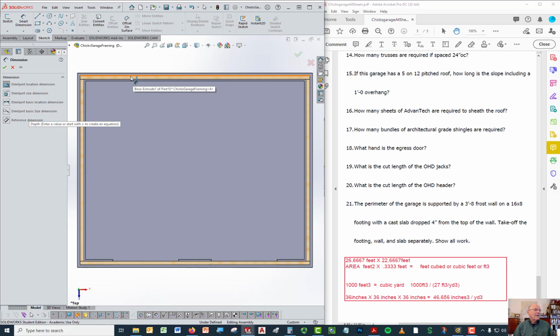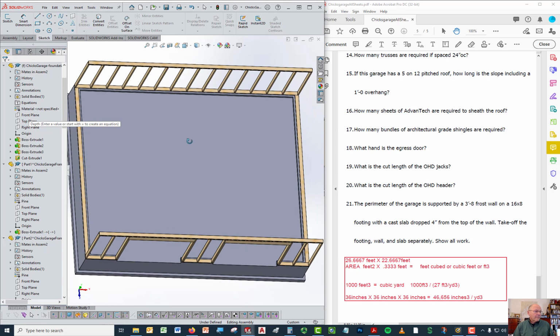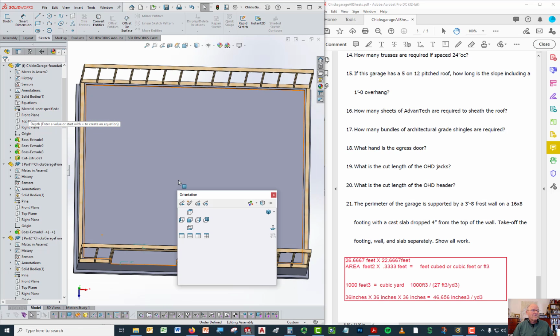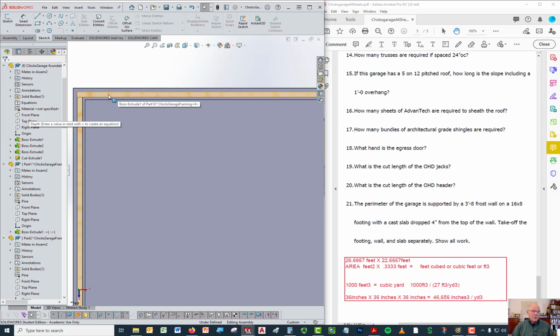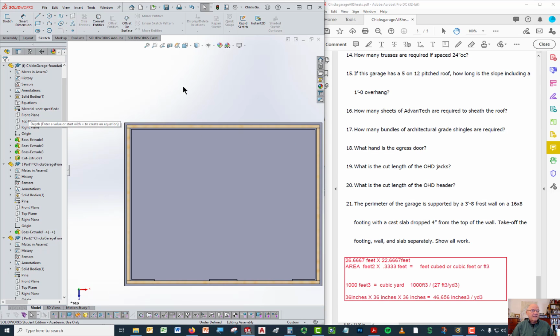and that would be right here, if the overall distance of that wall, by the way, we're looking down here at the footing, so when we're looking straight down at it, we're looking both at the wall and the footing. So just to clarify, the wall stops at the edge of this wood. The footing stops out here. So the wall stops here, but it goes all the way inside to here, so that distance from the outside of the foundation wall to the inside of the foundation wall is 8 inches. Same is true on the other side.